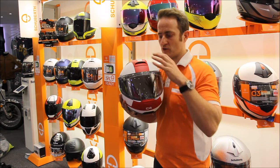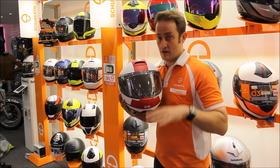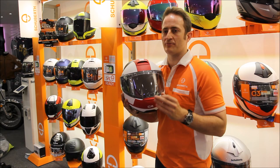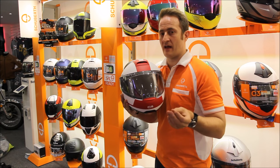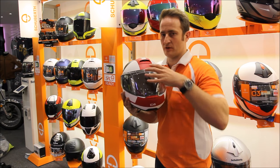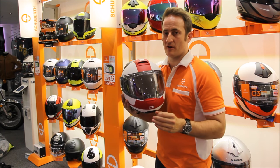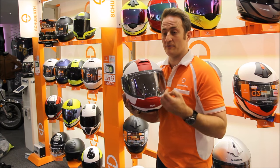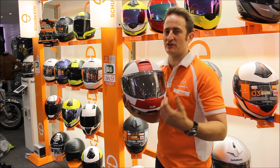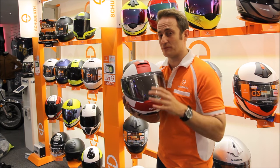We've changed the shell design, got a completely radical new shape, a far bigger visor, and some fantastic news on Bluetooth communications. The shell itself is made using a new technique called Direct Fibre Processing, or DFP. It's been pulled over from the aeronautics industry — a small gun fires the fibres onto the mould instead of using a balloon mould, which is traditional in fibre processing. The advantage is we've reduced waste, which is far better for the environment, and we keep tolerances much better than before — down to about 3g per shell.